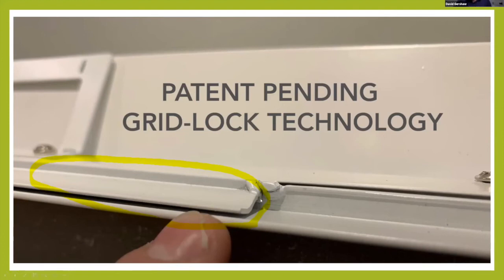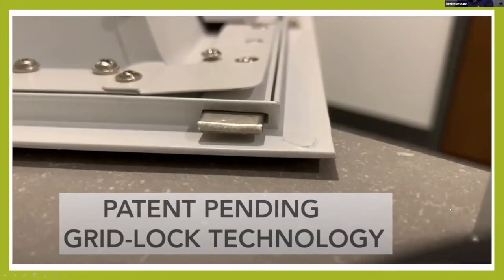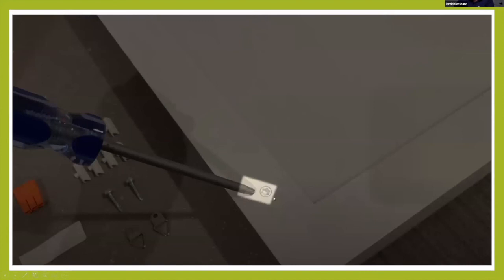And you can see the design of it. It's not a flat knife. It's got this kind of interesting shape to it. The reason for that is it helps you first guide it in, and then once it's pushed in, it helps put a lot of pressure to keep this pressed up against the ceiling plane. And then on the other side, you have those Torx expanding fingers. So here that finger is in its retracted position, and then it's expanded. See that? So when you twist that mechanism, it's going to pop out. And again, similar to the knife edge, it's creating a sandwich between the T-bar and that old fixture sitting on top of it. And there's the Torx expanding mechanism.